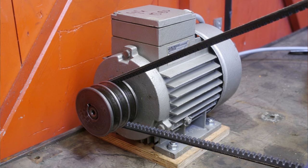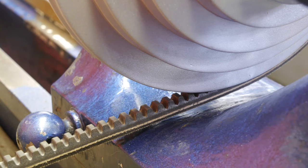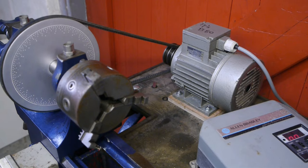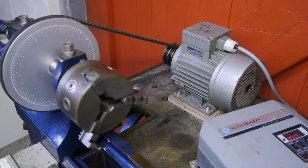Installed — that motor is not going anywhere. The belt is nice and tight. I did need a little riser block, otherwise the belt would not have cleared the headstock. I should have gotten a longer belt; that way the motor would be further away from the chips coming off the workpiece, it would last longer, and there would be more contact area on the small pulley — and that's where the belt usually starts to slip. The pulley was made for a larger belt size, but the groove angle should be the same and it's not bottoming out, though there is a bit of wear and rust damage on the pulley. I think it will be okay. I couldn't mount the motor the other way around because then it would hang over the side of the bench and it would be hard to bolt down through the cast iron legs.